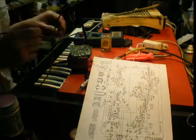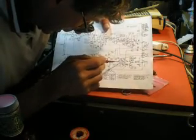After much confusion, I had made a measurement here in the part of the circuit where we've got the lines coming from this flip-flop, which flip-flops when you hit the switch for bypass or not. These junctions here have one-meg resistors coming from them and a filter for noise there. They go to the sides of the flip-flop, which will pull up or down the different sides to turn these FETs alternatively on or off to let in the bypass or the effect signal. I had measured here before and got no change when I blew on it, but actually I must have been getting a bad measurement because it actually does drop the side that's at ten volts down below eight, and the signal dies when that little bit of drain is encountered on the gate.